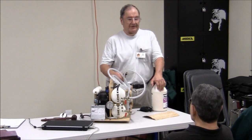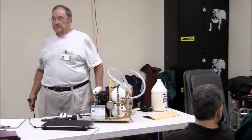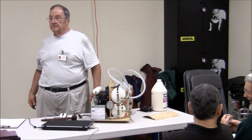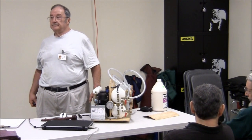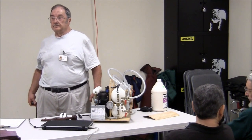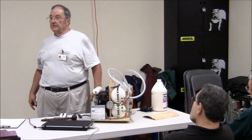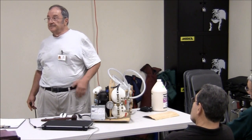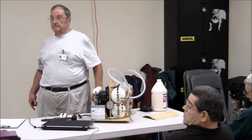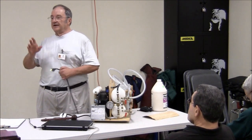Okay. Yeah, you make a good straight man there. Bob, yes, if my kit's venturi kit hooks up to a compressor, yep. You turn the compressor on and it pulls it back. Do you manually turn the compressor off or does the kit turn it off? The kit turns it off, and the thing that causes it to turn off is the vacuum switch. Okay, and so then if there's a subsequent leak, does the kit turn the compressor back on? Yes. Yeah. Well, take it back.